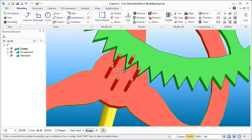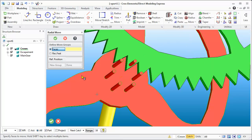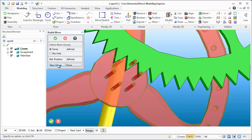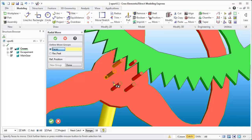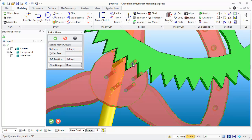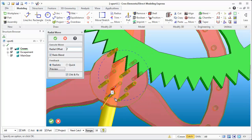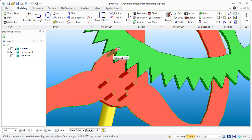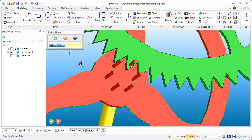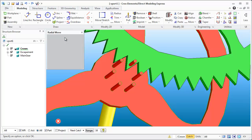With a value of 3, that looks good. Hit okay — and with radial move I managed to get all these pins to the center quite easily and efficiently. The key thing is: when you use radial move and choose your axis, you must choose each face as its own separate group using New Group. If you select multiple pins with Shift into one group, they all move as one unit rather than individually around the radius.